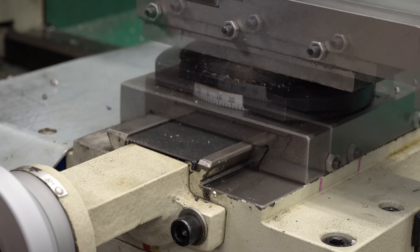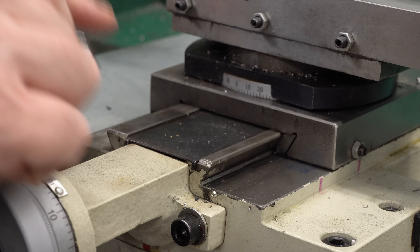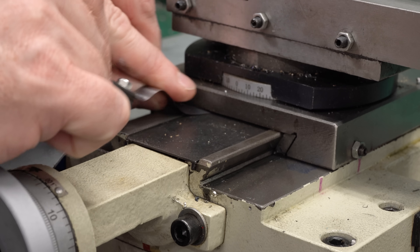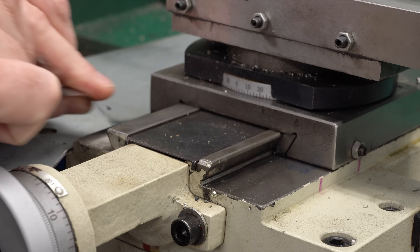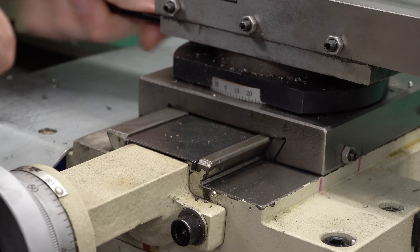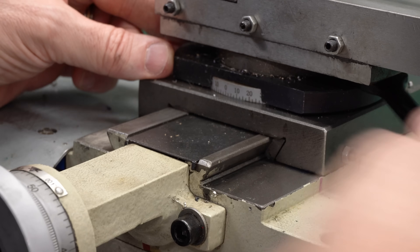On the left hand side, right at the front, there appears to be a high spot on the side of the dovetail that's actually striking the slide as well. There's a little bit of a gap as it goes back, but right in the front there's a high spot. So I think the first thing to do here is disassemble this — take the compound off, tear this down, and see what the fit is like without the gib.